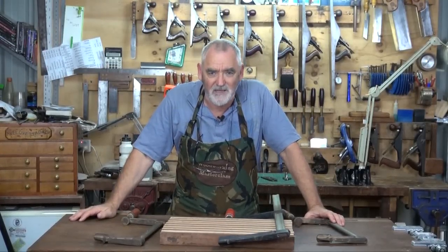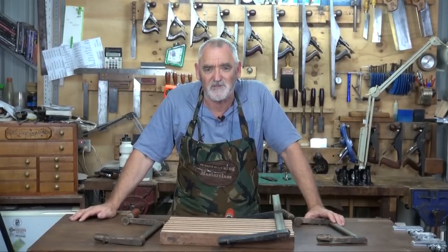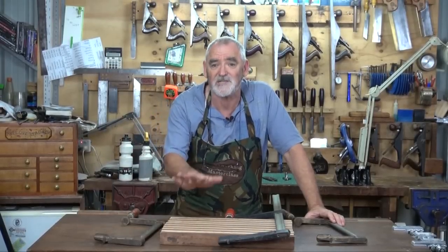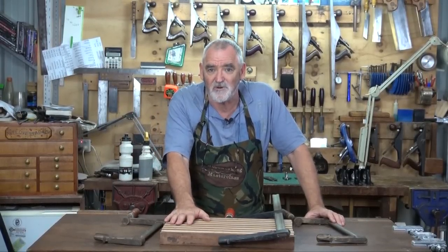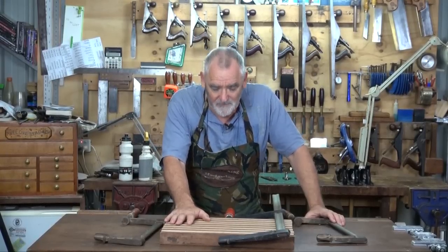Now, just a thing to think about when you are gluing it up, make sure you're working with a food safe glue. Most glues are inert once they're dried, but just check on the label. If you've got any concerns, ring up the manufacturer. I actually used Aquadhere external glue on here, which according to their website and specifications, is classified as non-toxic.